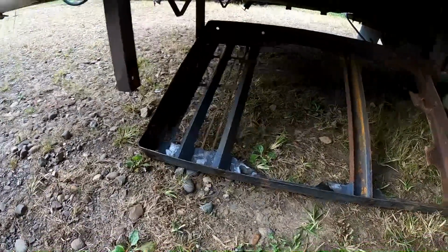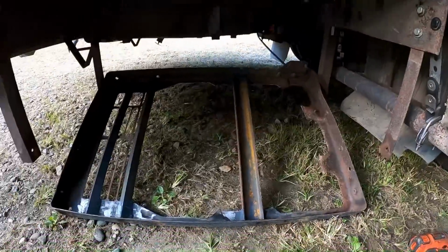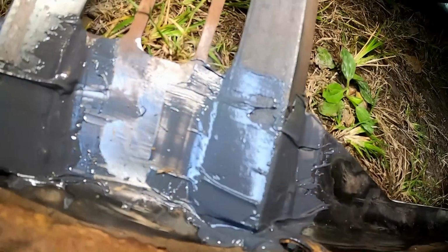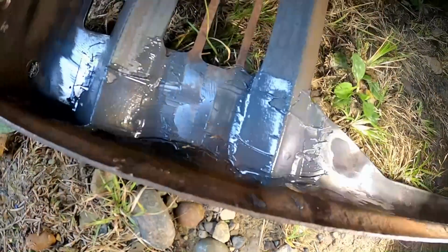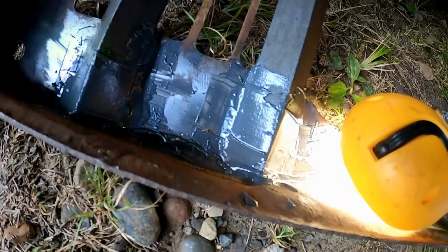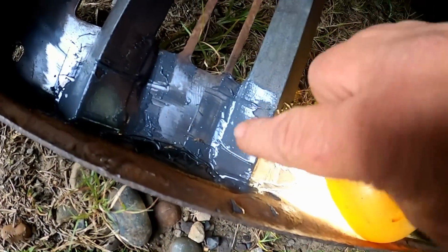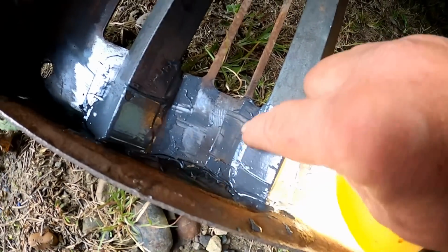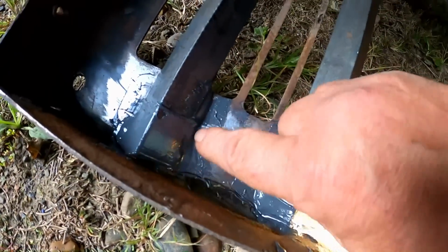But, all right. Oh, and here's that JB Weld stuff. I got a little messier with it than I planned on. I just wanted to get it where the angle iron met the stainless tray, and I slopped it up. I didn't mean to get it all over. I wasn't thinking, okay? It does no good up on top of the angle. The only point is the point of contact. That's where it needs to be cemented, cold welded, I'm sorry.